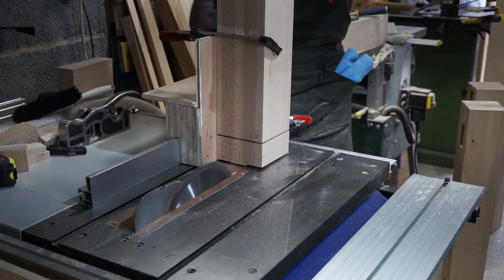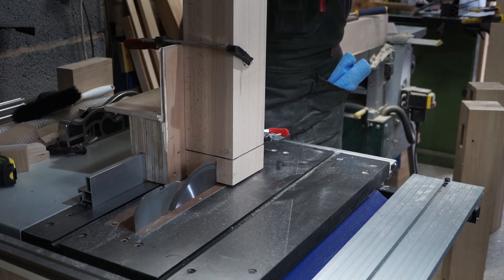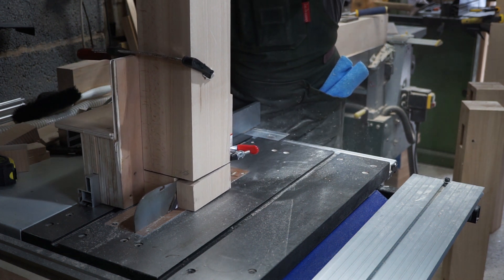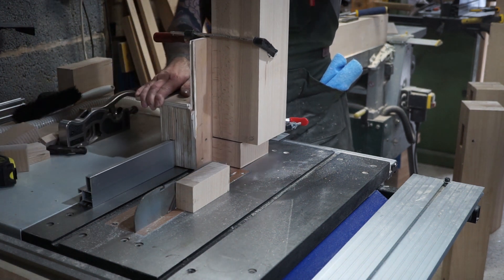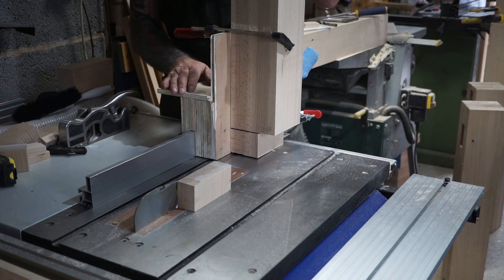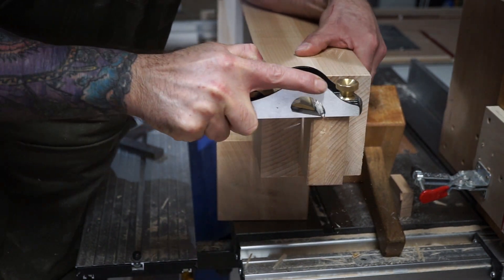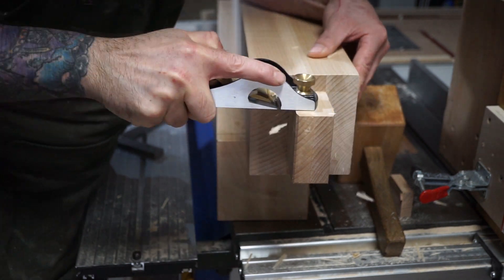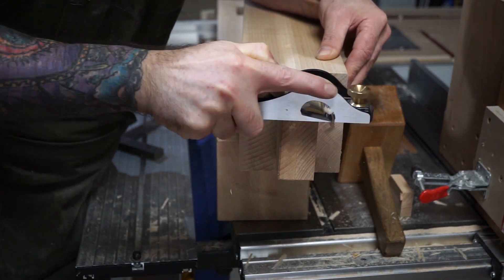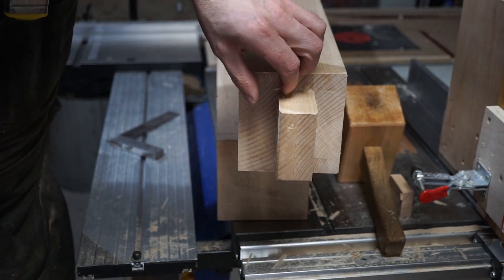To cut the cheeks of the tenon I use a shop-made tenon cutting jig. The workpiece is clamped solidly into the jig and the jig locks tightly over the fence. This isn't the ideal way to do this though, as I have no good condition blades for my band saw and I don't have a tenon saw with a deep enough plate to do it by hand. I don't recommend that anybody cuts tenons this way, though it does work and with the workpiece solidly locked in position against two reference faces, the risks are reduced somewhat. Next I refine the fit using a low angle rebate block plane and a large shoulder plane, checking for square as I go.